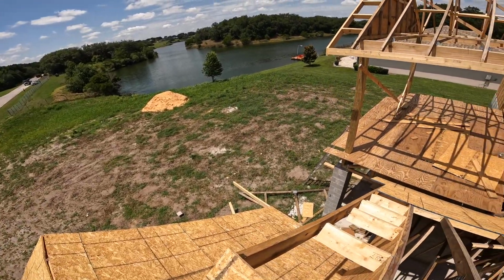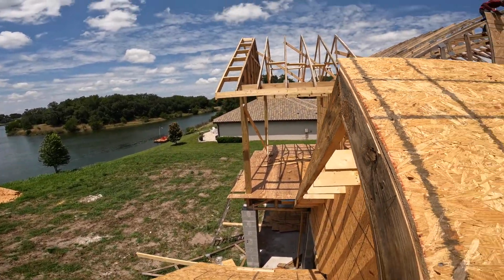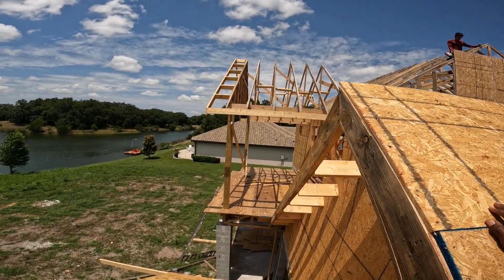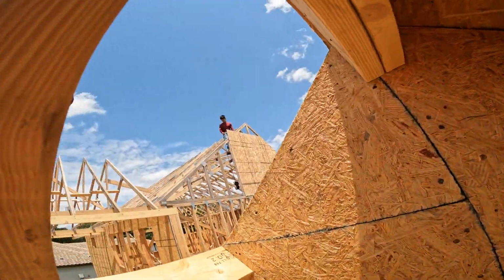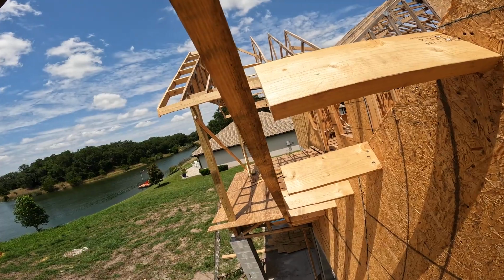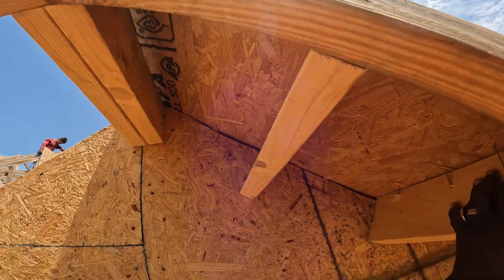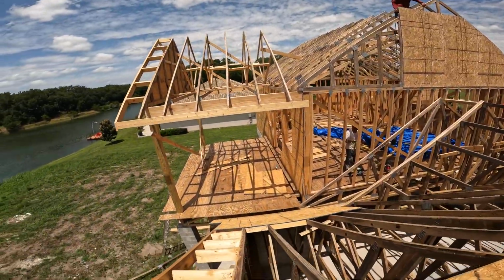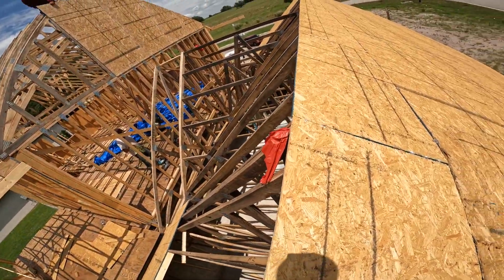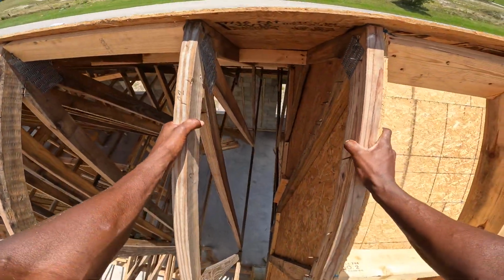So once again, this is not a plywood decker first problem. This was an existing problem before the plywood started on the roof. So as you can see, this here is not installed correctly either. This outlooker is wrong. A lot of shiners, what we call shiners. And there's a lot of that on this roof right now, which I also have pictures of. Okay, coming back down.